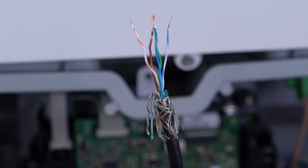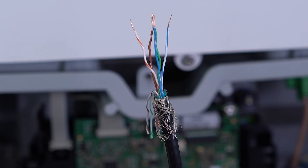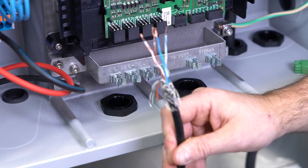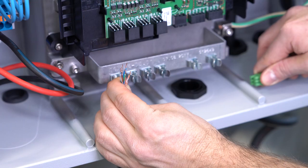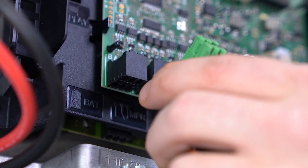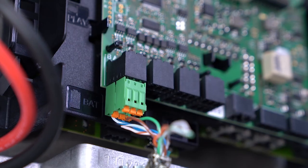All we need for the communication between the battery and the inverter itself is this CAN bus communication cable. We have already stripped the endings of the CAN cable. Unless provided as part of the battery, SMA recommends using a cable such as a CAT 5E or similar. Note that the cable is not provided in the scope of delivery. Next I'll pass the cable through the intended cable gland. Then I will connect the cable to the battery interface plug according to the quick reference guide and to the battery manufacturer's instructions. Insert the battery communication plug into socket BDO1 until it clicks in place. Please press the communication cable with the cable shield into the shield clamp.